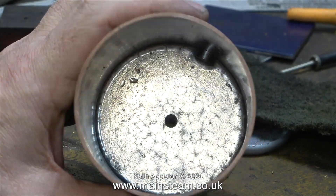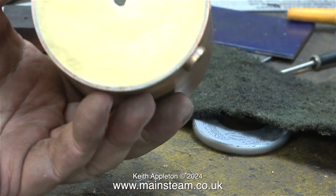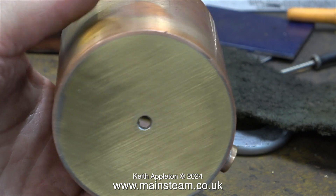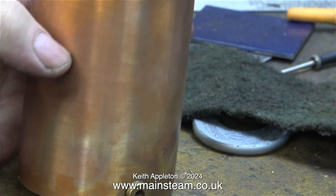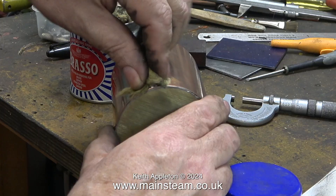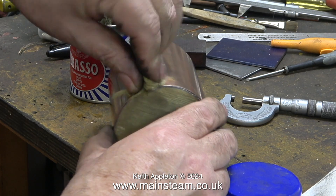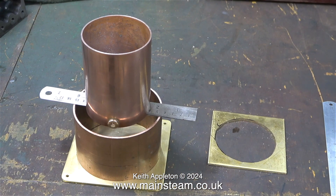Here are a few shots of the inside of the tank. As you can see the entire bottom part of the tank is covered in solder, and you will notice there's a fillet of solder around the outside edge — this is good, it's a very strong joint. Once the tank had thoroughly cooled I cleaned it first on the polishing spindle, and here I'm finishing off the job using some Brasso wadding.